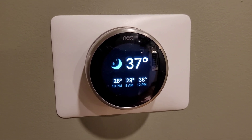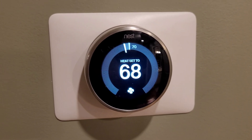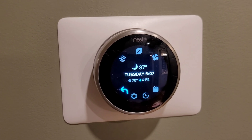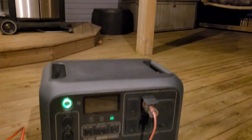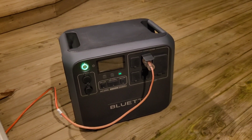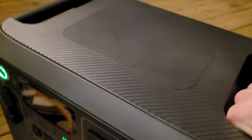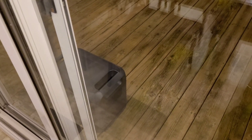It's just after 6 PM. We're sitting at 37 degrees outside — hit about 40 this afternoon — so temperatures in the house got up to 72. The heat pump has been off for about an hour and a half. It is now dark outside with no solar helping us. I've got the AC200L plugged in — as simple as that. One of the main reasons I bought a 120 volt heat pump is the versatility for setups like this.